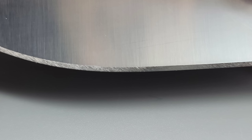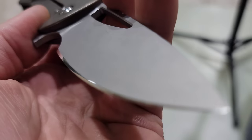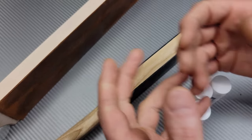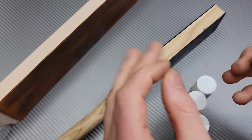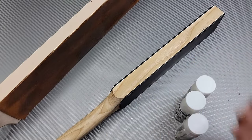How does it work? Basically, you're replacing a scratch pattern with a finer scratch pattern. If you're polishing, you're taking the scratch pattern you have and replacing it with a finer one, continuing until you reach a very fine scratch pattern that comes out as a polish. You can also use it for edge maintenance — using the microscopic diamonds as an abrasive to create a scratch pattern at the very tip of your apex, giving it teeth and bite so your edge feels nice and sharp and acute.